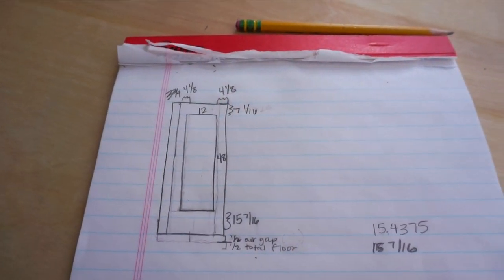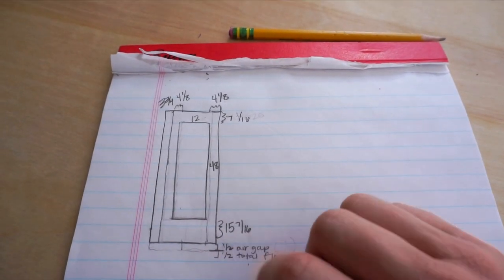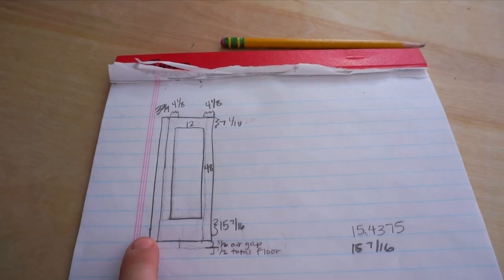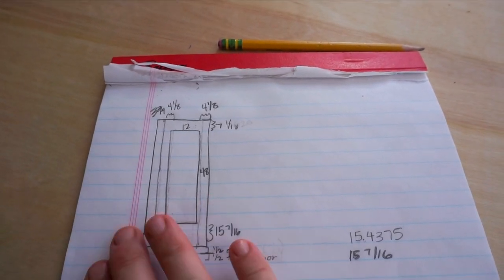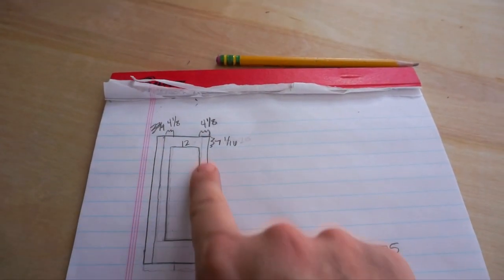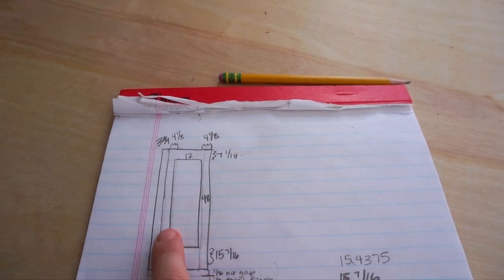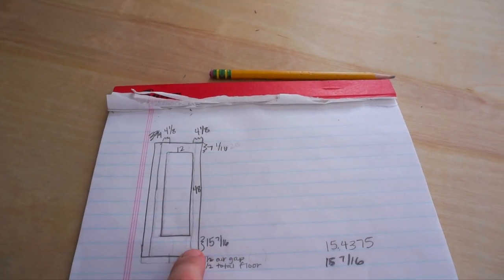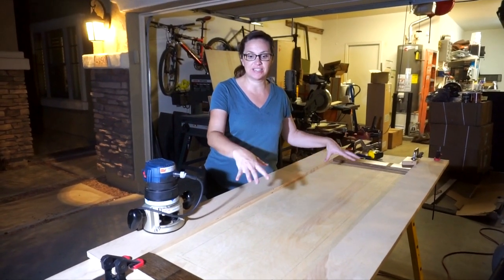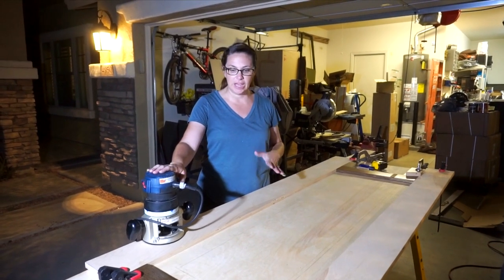Here's just a little sketch of all the measurements we need for the door and where we're going to put the mirror. A couple of things to consider — there's going to be three and three-quarter inches of the door that stays tucked back into the pocket when the door is fully closed. So if we just centered the mirror on the whole door, when you close it the mirror would be off-center to the left. We made sure to center the mirror only on the part of the door that shows when closed. We're using a quarter-inch straight router bit and we set up some fences.